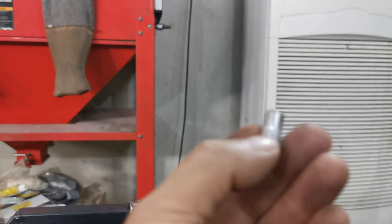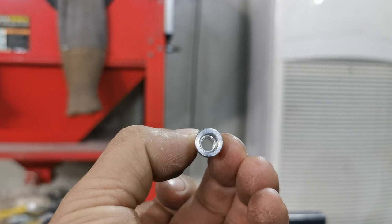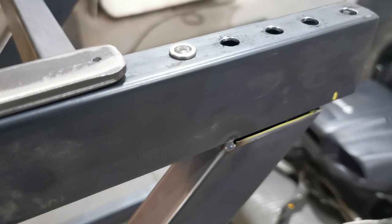So this is an insert. You drill a big hole. This is basically an insert with a thread inside and riveted in, much like a normal rivet. They're going to sit in. I'll put a load of riv nuts in all the way along,